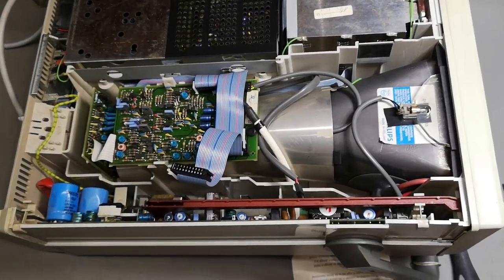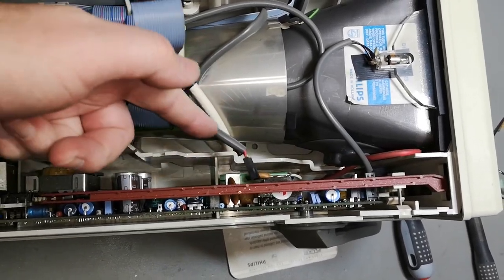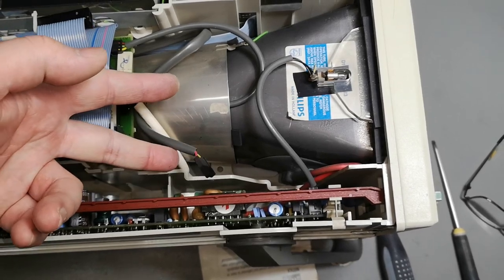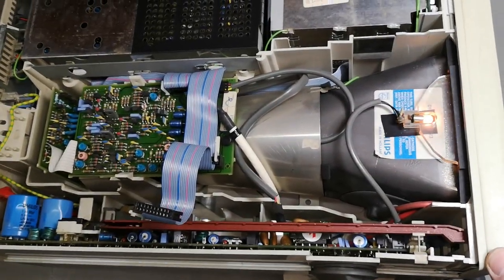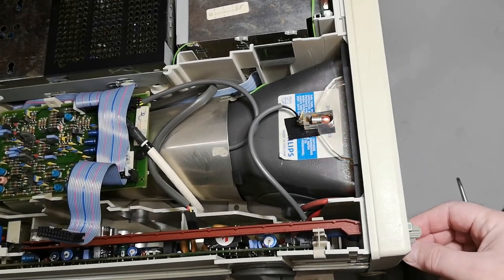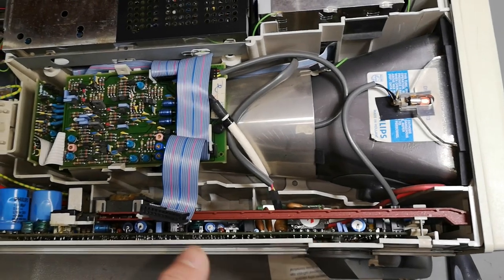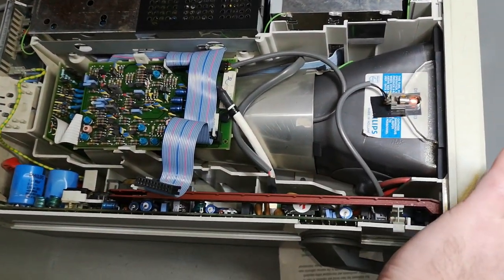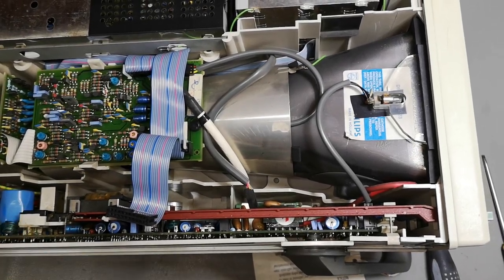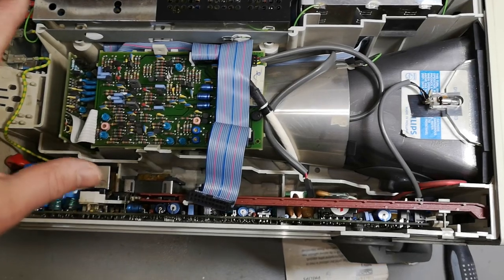I removed the two output connectors from the power supply, but there's a third one that goes directly to the scale illumination. So now I'm not loading the power supply. Let's try turning it on - look, scale illumination works. The power supply is using 19 watts idle, which can't be right, and I still hear some sounds. But this proves I can power up the power supply without the scope connected - that's a big help.